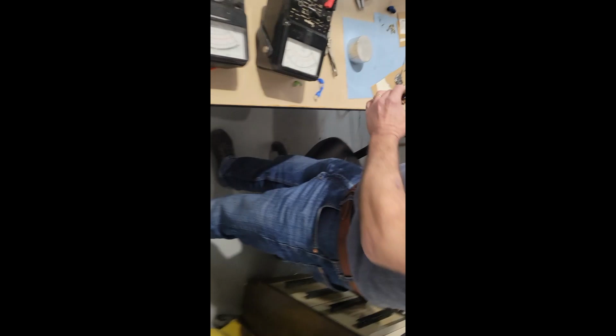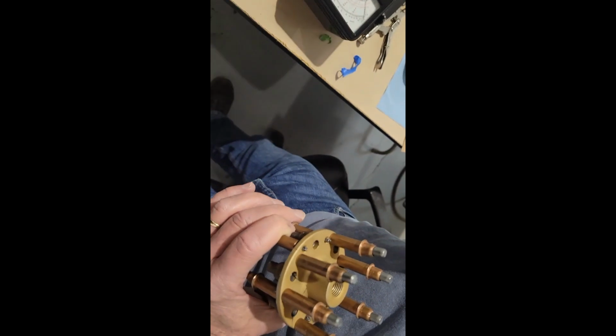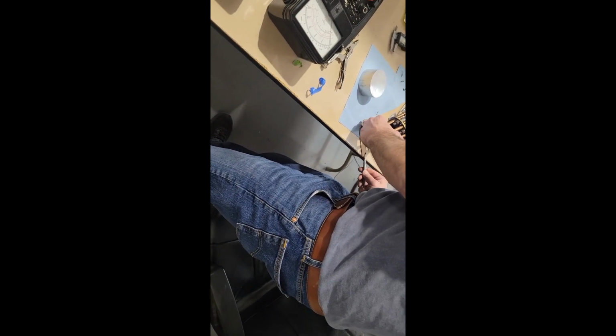Anyway, Doug is over here and he's riveting up the other flange. We had to get that flange out of this wing because these are very special nut plates. They're sealed, and we wanted to reuse them because there's nothing wrong with them. So we drilled them off of the old plate, and Doug is gluing them down and getting ready to rivet them in place. Then this will go in the left tank, and then we can put the window frame in it, and that tank will be done. And I'll be back.